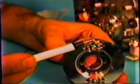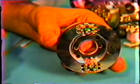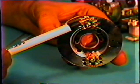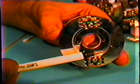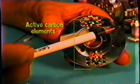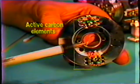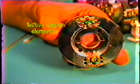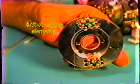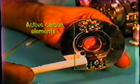We have an active element here and an active element here. A four-headed VCR could have two heads here and two heads here. That is what we're seeing in the newer machines being built today. In the older ones, there was one here, and one across from here, and one here. On a four-headed machine, in playback mode, they are only using two at a time.